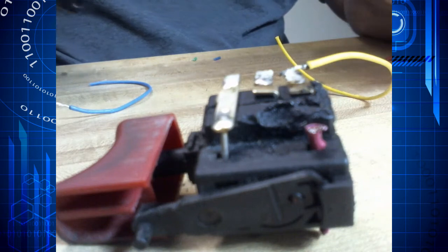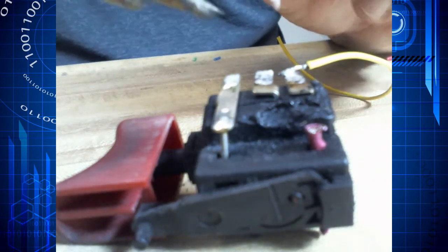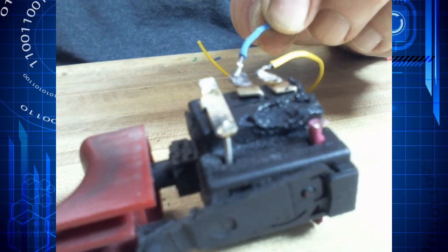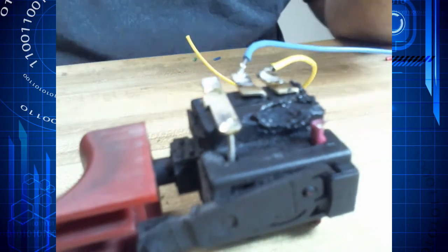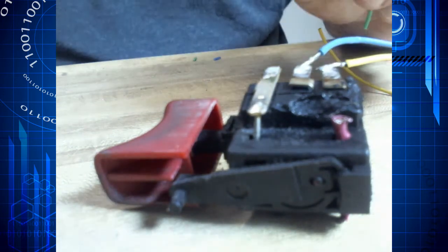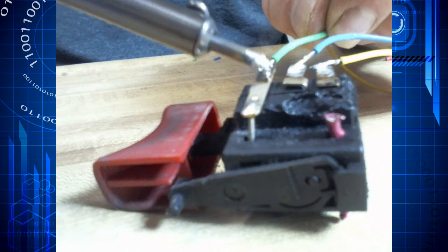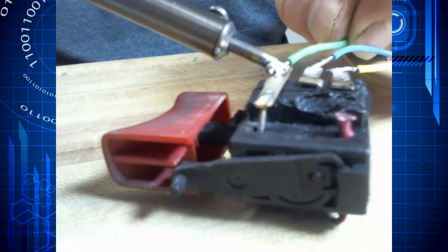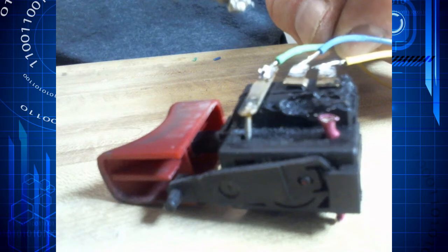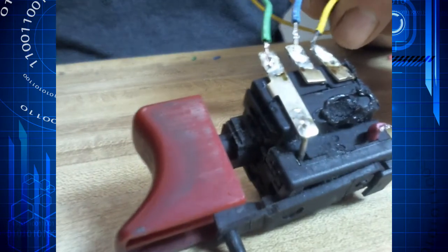You can also do this from the top — you don't want to put your soldering iron over the wire, but you can melt your solder right there. The reason you don't want to put your soldering iron on top is when you pull it away you're going to leave yourself a nice little blob, and we're trying to keep everything as flat as possible. So there you see we've got three nice solder joints and everything is looking pretty good.